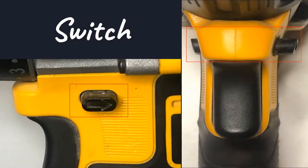The next thing is the switch, which is the little button-like device next to the trigger. This switch changes the drill from forwards to backwards to safety. When the switch is pushed all the way to the right, the drill is in forward; all the way to the left, it's in reverse; balanced in the middle, the drill is locked — even pushing the trigger does nothing. This is the safest way to transport drills so they don't accidentally hurt someone.